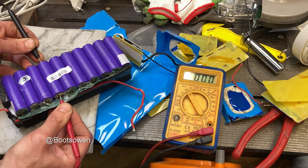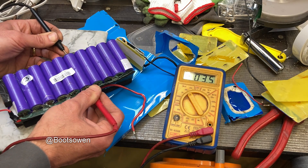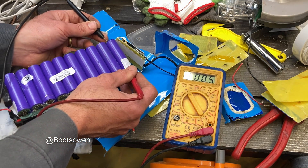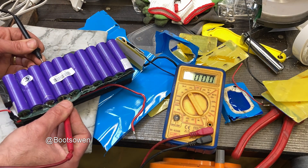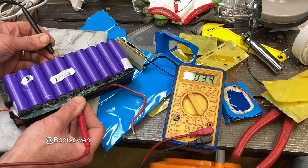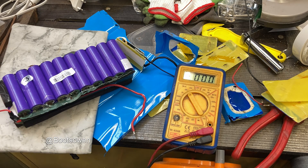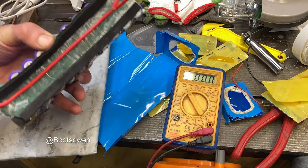0. That's 0. Doesn't look right. 3.3. 3.5. 3.5. 3.5. 3.5. 3.4. So somewhere here it's coming up as a dud — completely zero there, and here 0.03. So this set of six cells below my fingers are a dud. So the battery's a dud, but it still has a bit of power left in it. I'm not entirely sure what I should do with this — it has a load of good cells, but also a load of bad cells.